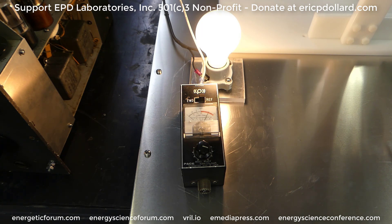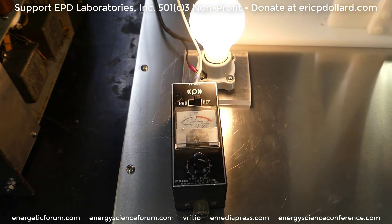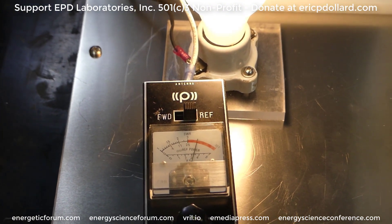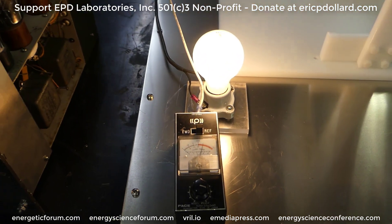You can't do this with digital — you've got to have analog in order to move it right down to the lowest, almost right on frequency. As you can see, the oscillator is drifting a little — just a couple of cycles per second difference out of millions of cycles a second. Collins oscillators are really tight and they're continuous; none of this digit-step stuff, which you couldn't possibly get a zero beat with. So the Collins can now be hooked to the coil — we found the frequency.